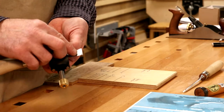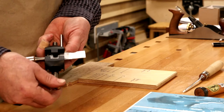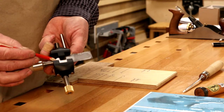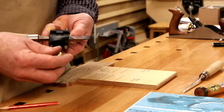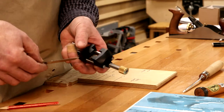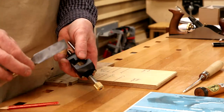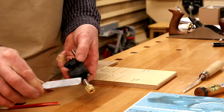You will have taken 3/8 off the front. So at the moment, yes, it will grip. Once I get up to here, and this is where the curve starts on the back, I'm losing that accuracy. So one of the things I did want to look at was, will it hold a short butt chisel? It will, but you've got a certain life expectancy, but that's quite a lot of life on a butt chisel to wear 3/8 of an inch away. You're going some, okay?